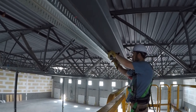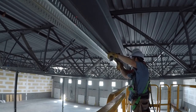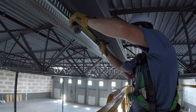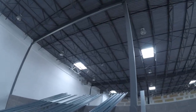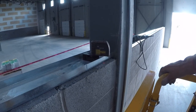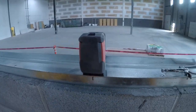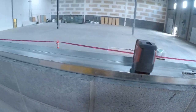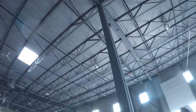You don't need to plumb up a stud every 10 feet — each bay is about 40 feet, so you can do one at the beginning of each bay. But even over 40 feet you can lose your centers. I like to check so that I don't have to go back and fix anything. There's always a center close enough to the end of the track. That Bosch laser was inside the column because of the plate and the bolts at the top. I'm plumbing up a center at the end of the track — the first piece in this bay, which will be what I use for all my centers.